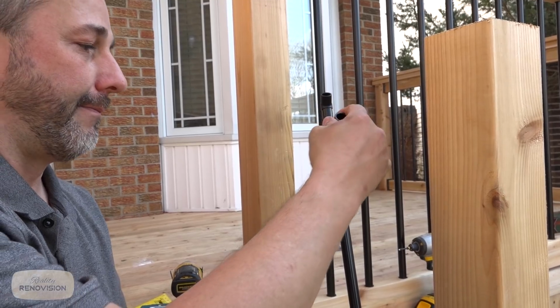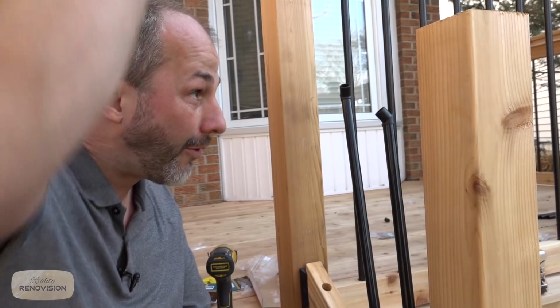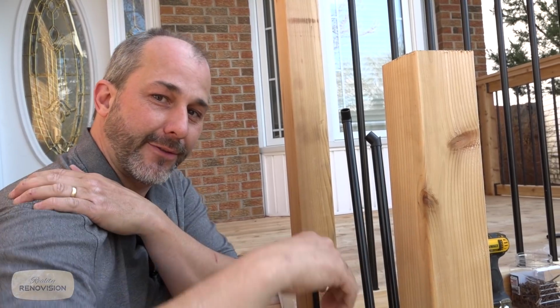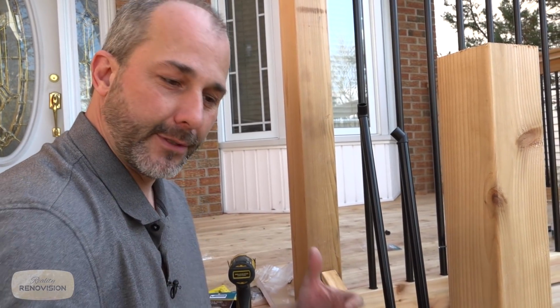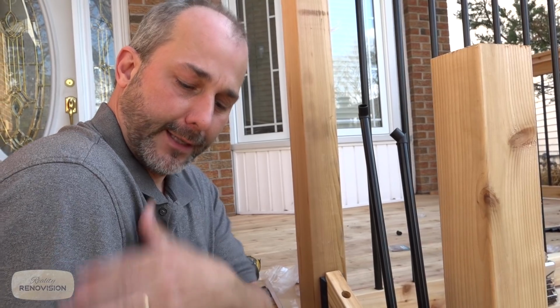So, boom, we cut it down so that when grandma's climbing this railing, she isn't holding a railing above her head. Because honestly, 42 inches, that's hard. Most older people don't have a lot of strength in their shoulders, and they're using their bicep and tricep muscles when they're going up a railing. And so when you're setting safety rails in bathrooms, it's usually pretty low so they can have their arms straight to their body and they can grab something like this, okay?